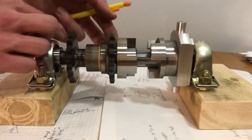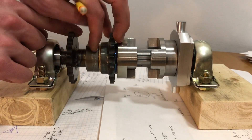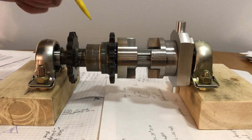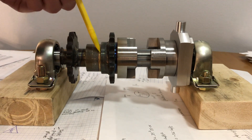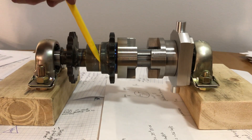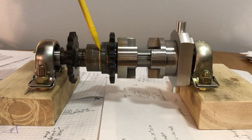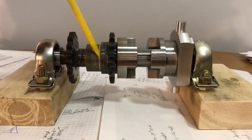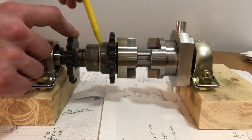When you disengage the clutch it does spin, and the surface speed can be quite high, but there's no load in that case — so again, a very low-grade bearing is sufficient. A bronze bushing could be used under medium load and high surface speeds, but you'd probably want some forced lubrication in that scenario. Here you have either high surface speed with no load, or high load with zero surface speed, so the bronze bushing is a great choice. It's also very low profile — about a sixteenth of an inch thick.